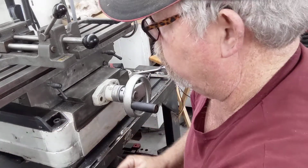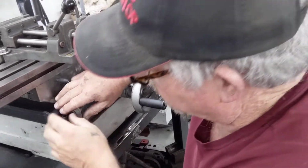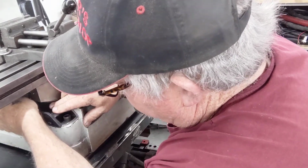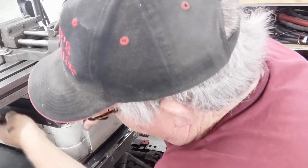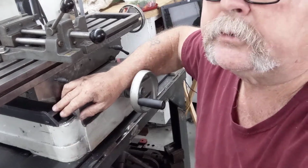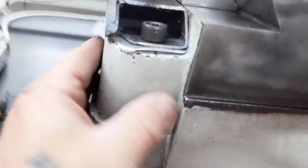Let's lay the reader down over here. Got to be easy since it's glass. Now, if you can get down here, yeah, we can get down low enough. I also have adjustment in and out and back and forth on this. So when I'm tramming this in off the table, I'll be able to adjust it, and I've got around 3/16 overhang that allows for this. Let's pull this out real quick. These have a slope to them, and that reader would foul if this was up flush.